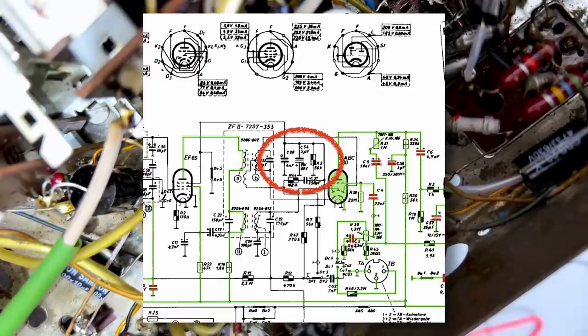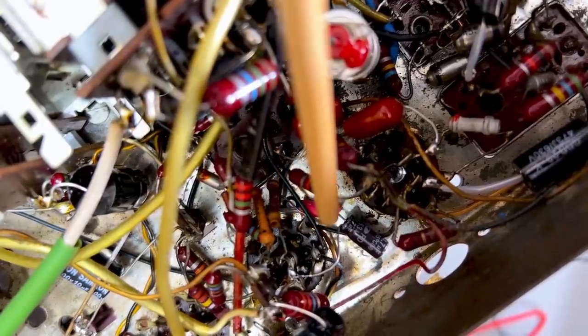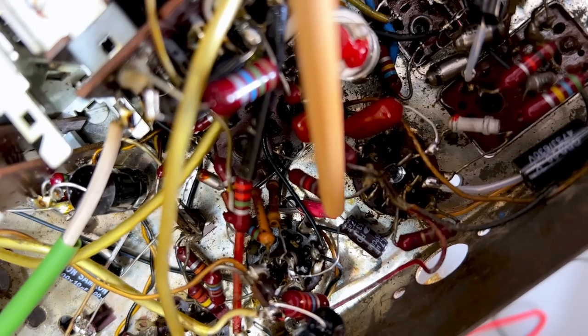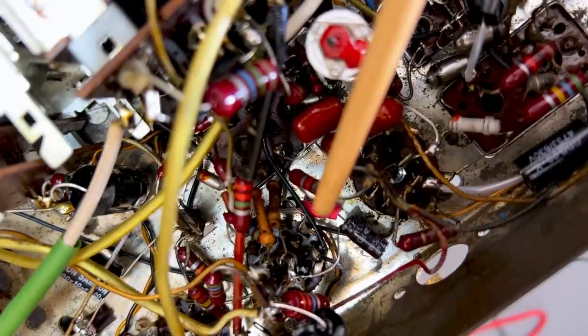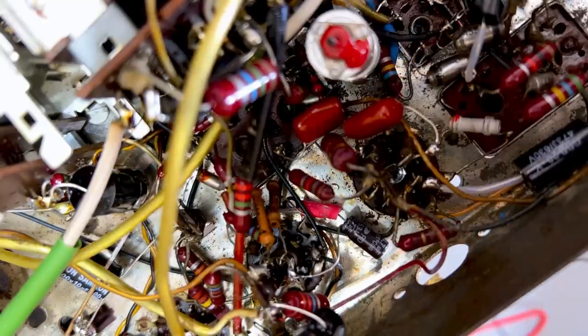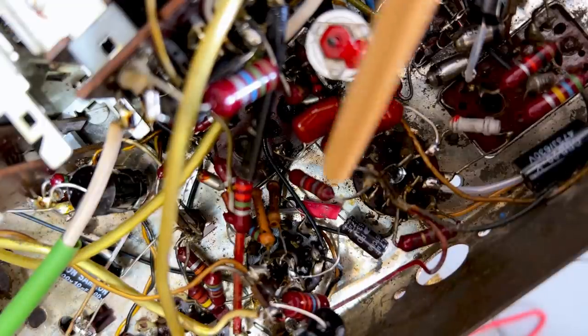That capacitor goes across the two diodes on the EABC80, and that's also the most important point for us to measure. I've put a bit of sleeving in there because I couldn't really get to the pin. I cut the old cap and did a pigtail thing, putting a bit of sleeving on there which I can pull back to cover that wire. Now, this capacitor is sort of reversed — the positive goes to ground, which is the center of that tube, and the negative goes to the pin because the voltage generated across there is actually a negative voltage. It's also very important because it gives us an indication of signal strength coming through, so we can use that for the alignment.